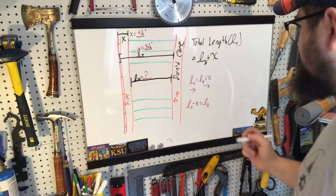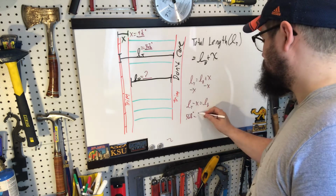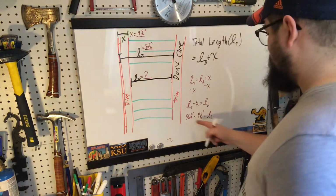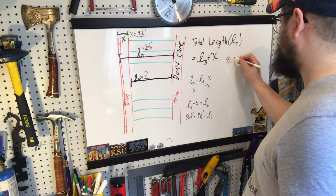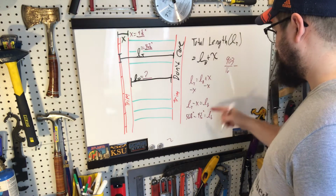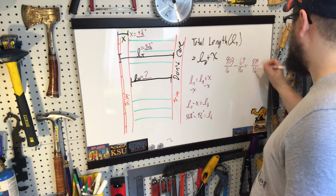All right. So we know in this case the length total is 56 7/16 inches minus this, 4 5/16 inches, equal to the length of the board. Now this is a mixed fraction. There are ways to do it, but I like to have an improper fraction. So when I did this, I multiplied 16 by 56, and then added 7, so that gives me 903. I already did the math ahead of time, so I didn't do this in my head. I actually used a calculator for this part, because this is what I like calculators for. I don't like them for doing equations and stuff, but I like them for this. And then this part here, 16 times 4 plus 5, that is 69 over 16. All right, and when I subtracted that, that gave me 834 over 16.